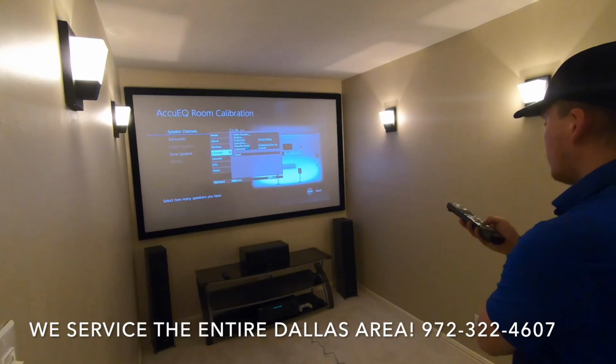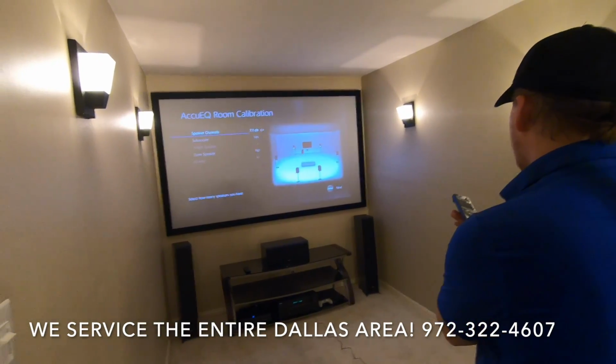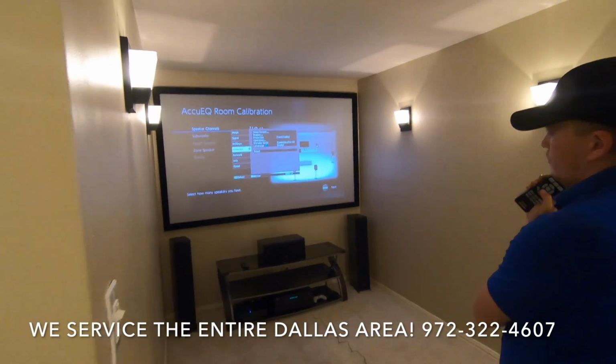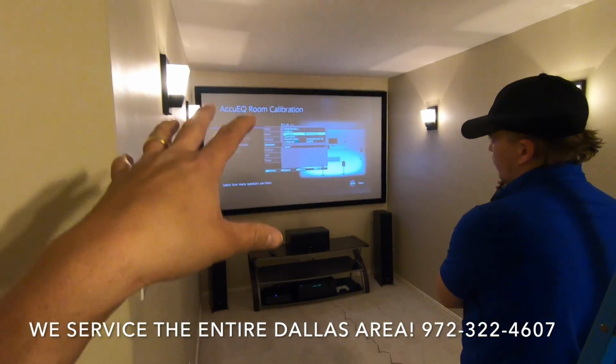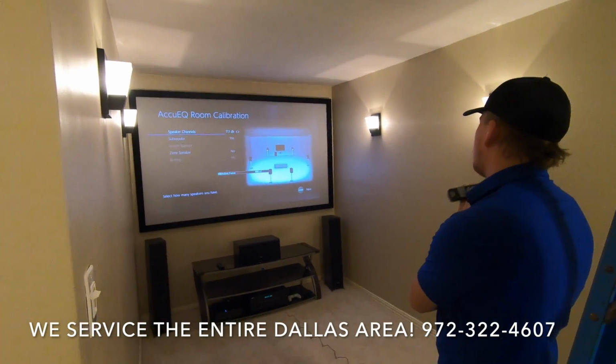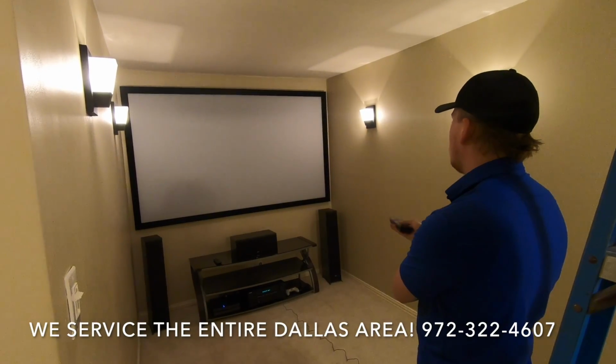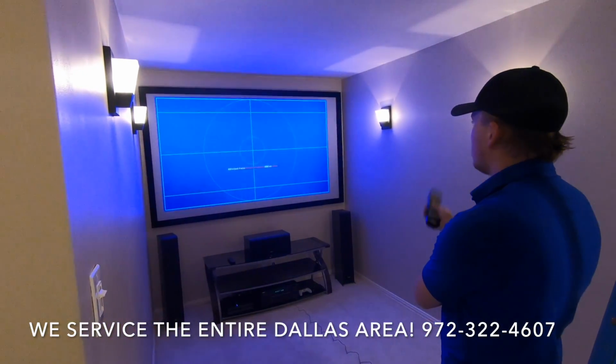So the first thing you're going to do whenever you power up the projector is go into the menu under extended and go to projection and flip the image to front ceiling instead of front, which will then give you the proper orientation so that you can read the menu. And then you're going to hit your pattern button first, and then your lens button, so that you can get a pattern.